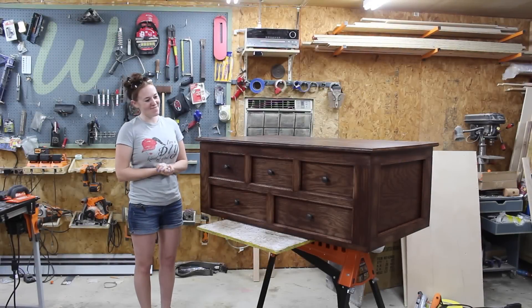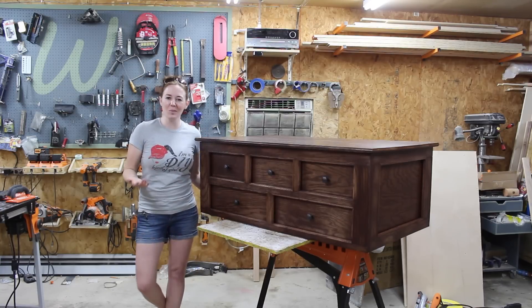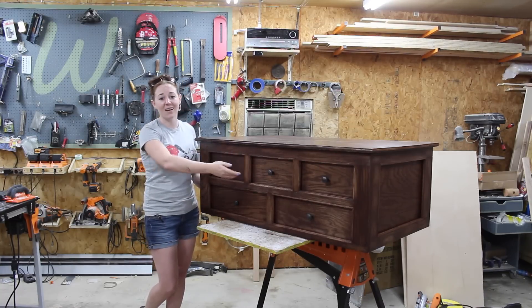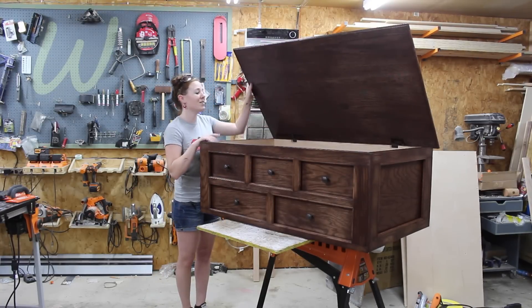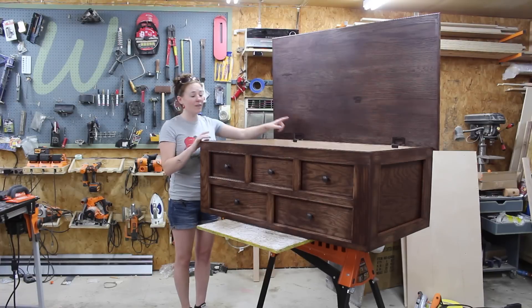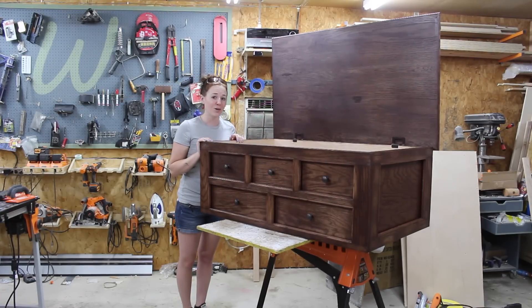And here it is — I'm pretty happy with it. Keep in mind if you want to build something like this it's just a box decorated with trim. I made it a little more complicated by making my own molding, but you could buy off-the-shelf molding or completely customize the design. For the hardware I went with torsion hinges because they maintain their position, so no worries about smashed fingers and you can just leave it open while you fill or unfill it. You can find these at Rockler, who is a sponsor of my channel — thanks Rockler for supporting what I do. I've left links to the hinges plus everything else used during the project in the description.